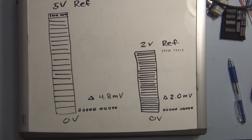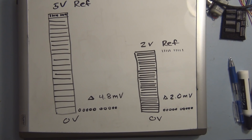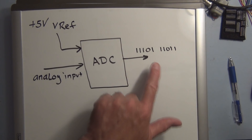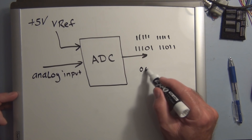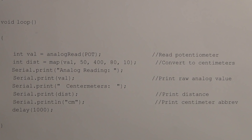I don't know exactly what 2.0 millivolts translates to in terms of distance — how small a change in distance produces a 2.0 millivolt change — you have to figure that out on your own. It may also be unique to the reflective quality of the object you're detecting, and you'll need to determine the maximum and minimum output for your particular IR sensor, which might differ from the datasheet graph. Once the ADC has its reference voltage, it assigns a unique binary number to the input: 0 volts gets the binary 0, and the reference voltage gets 1023.